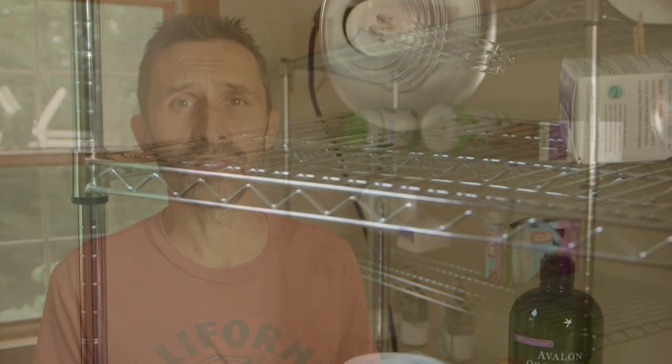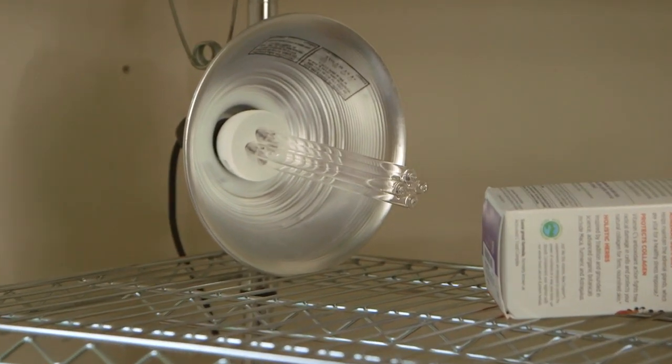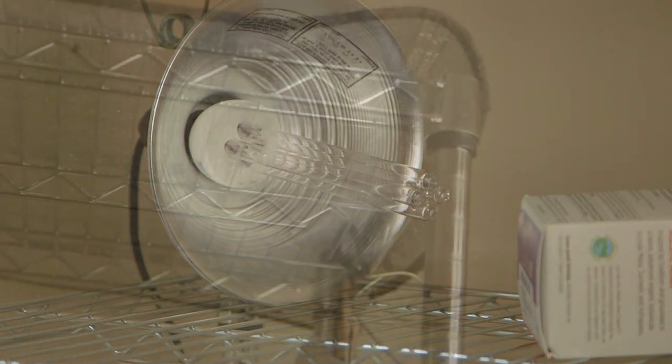The one challenge with UVC light, and I suppose it's the same challenge with bleach or anything like that, is that it has to touch every surface of an object, and if there are shadows created within that object, anything that's in those shadows is not going to be sterilized. So that's why I have lights on all sides, on the outsides, in the middle of the rack. And also there is some foil.